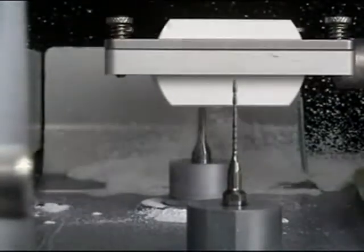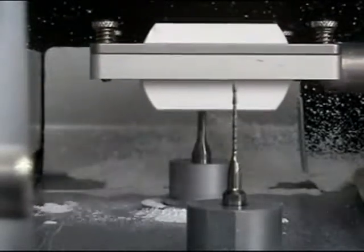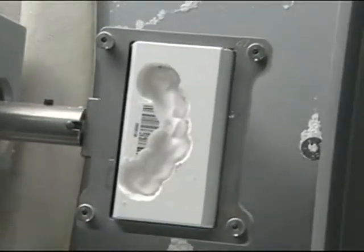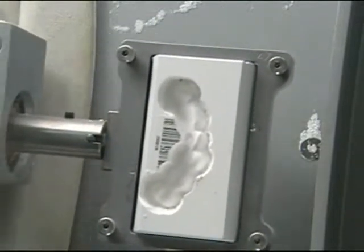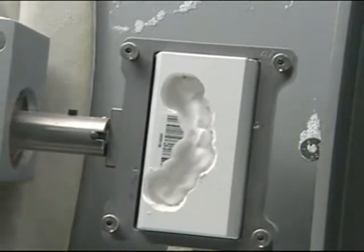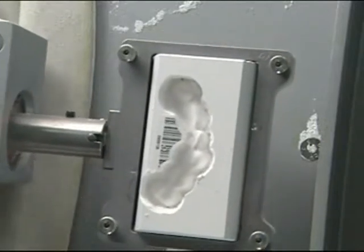Rough milling works in the usual meandering fashion. During fine milling, the inner coping surfaces are milled circularly to ensure an optimal fit. Like with single copings, a membrane around the framework forming the connection is perforated as the last milling step. The complete milling process for this bridge took 40 minutes.